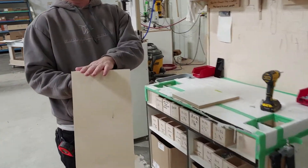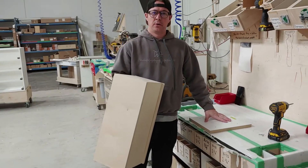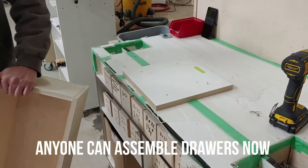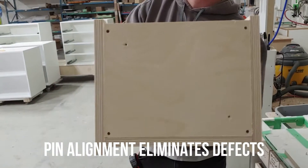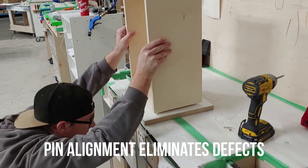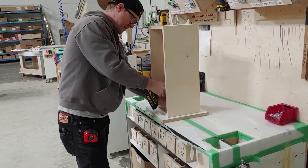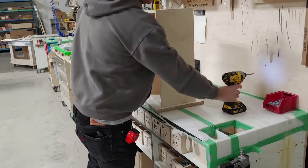With the new way, all of our drawers are going to be standard heights. If our bottom two drawers have the same drawer front height, the two drawers should be the same height. We take our shelf pins, put a couple pins in the drawer front — you can see on the face of our drawer we have holes here for them. The drawer is perfectly lined up, screwed on, and done in less time than it took to get the jigs out.